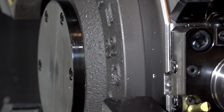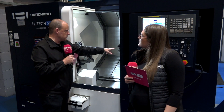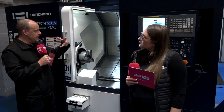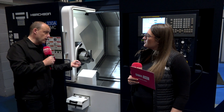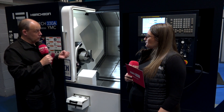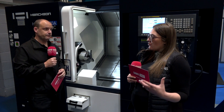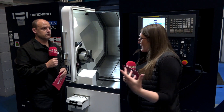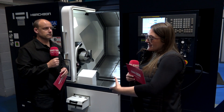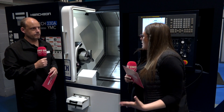With a little engineering ingenuity — as you can see with two turning tools and driven tools next to them — you can create a turret with as many machining opportunities as possible. On a smaller turned-part machine you're likely to need more tools, which means the programmer can create more complex parts without removing the part, changing tools, or replacing setups. You can have your whole setup on one sheet: tools, program, one job — done. On to the next.